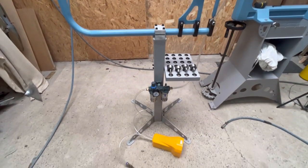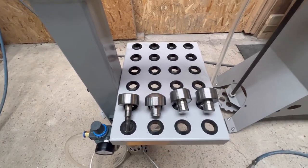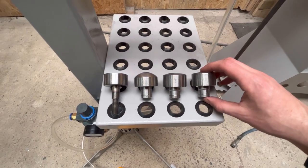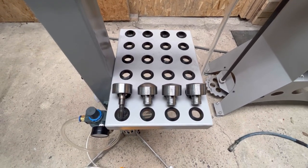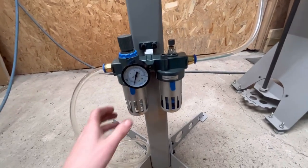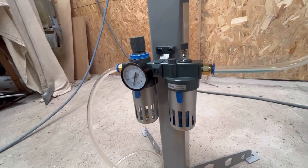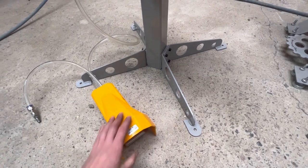This is the machine all set up. It has a tool holder with capacity for 24 anvils. What you get with it is a top anvil for the machine, plus a one inch, two inch, and three inch radius anvil. These are easy to make if you want more or a different style, and Matt will be making them available on the website soon. You also get a water trap with air pressure adjuster to help with speed and setup, an oiler for longevity, and a foot pedal to use like an accelerator.